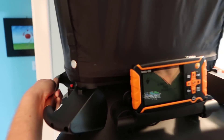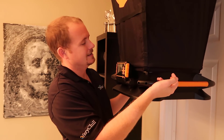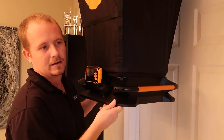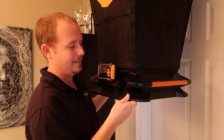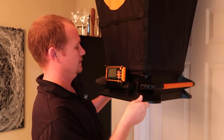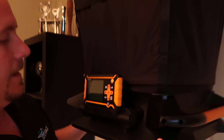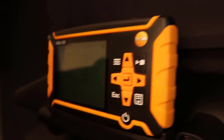48 CFM is a pretty good average of what we're reading here. The bad thing with this flow hood is that I'm not really getting a workout — that's why I like my older, heavier unit, because it feels like I'm working on my biceps. This thing just doesn't give me the oomph I'm looking for. We're reading 80, 79 in that range.